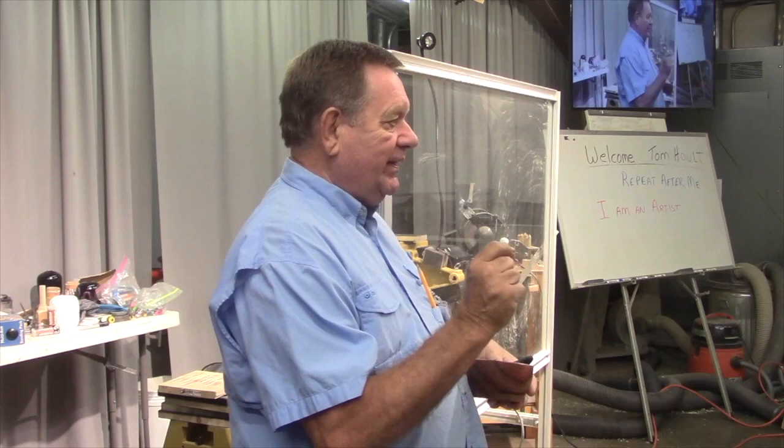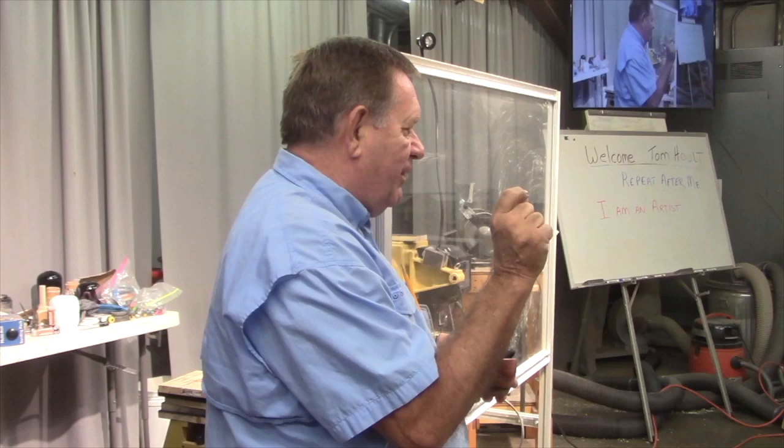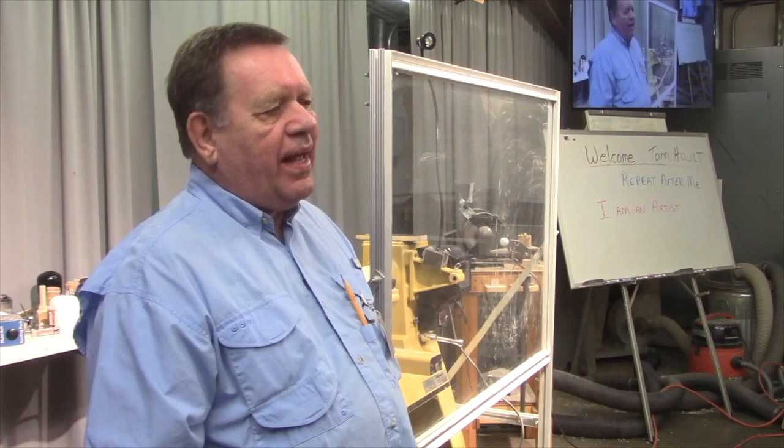And the thing about working on a Hatteras yacht, and you were dealing with teak and exotic woods, is whenever you put a screw into the piece of wood, you have to recess it. And then you take a wooden plug of the same wood species, and you put it in there to cover up that screw. But the grain direction of the plug has to match the grain direction of the wood. So you had to be very meticulous to get it like that. So, I've had that experience for almost 50 years now.